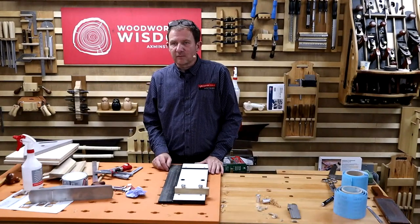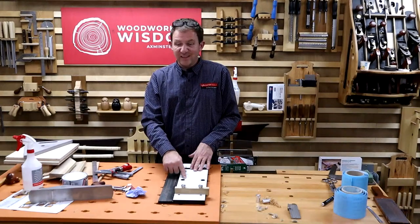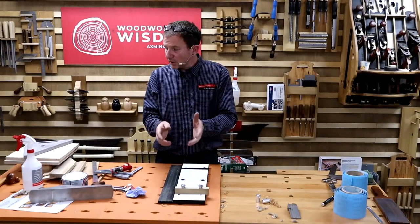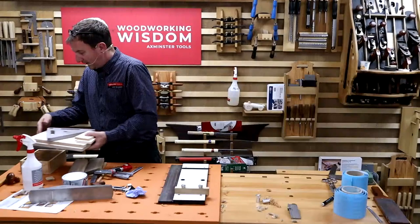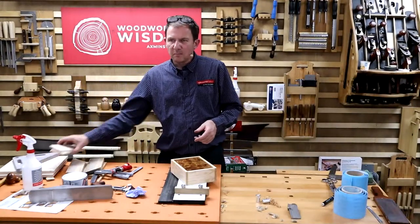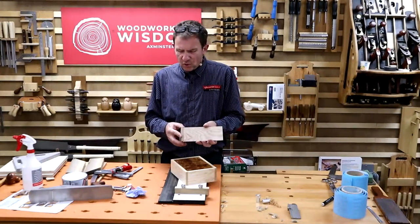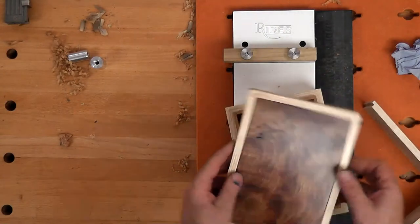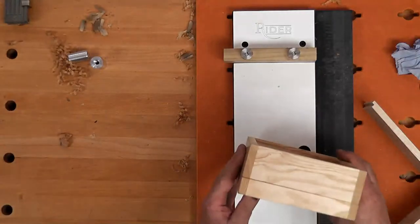And yes, it's something I've often, I'd love to have a wider one. But how many times are we going to use it? This, as a standard? Oh, yeah. Shoot the end, get things so they come together nicely. Such an important part. That simple thing of that little box under here was a real godsend when you're trying to make, and I'd hoped to have the shooting board ready by then. Just hadn't materialized. But to shoot things and get them dead square so you can do your nice joints, which is helping get everything square, fits together. Ah, it's beautiful.